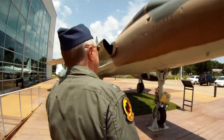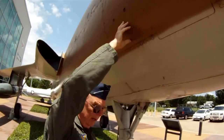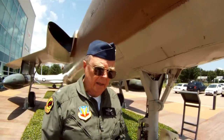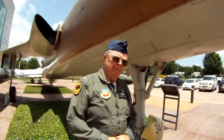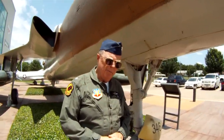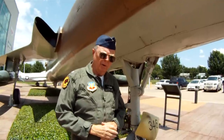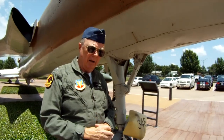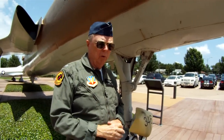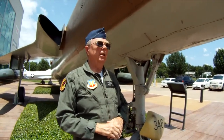On this side, up here, this is the battery compartment. As far as I know, the F-105 was the first production airplane to have a NICAD battery — it's a 100 amp-hour battery. It would carry the entire electrical load for almost an hour, and if you pulled one circuit breaker, you could extend that to two and a half hours. You'd lose some things that weren't real important, but you could make it last two and a half hours — generally enough to get the airplane on the ground.